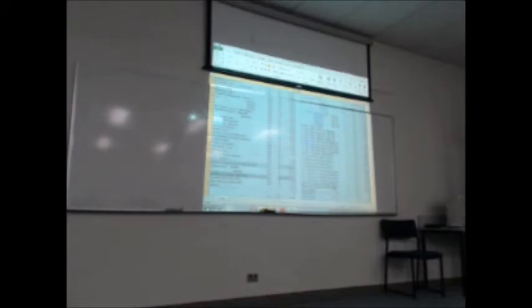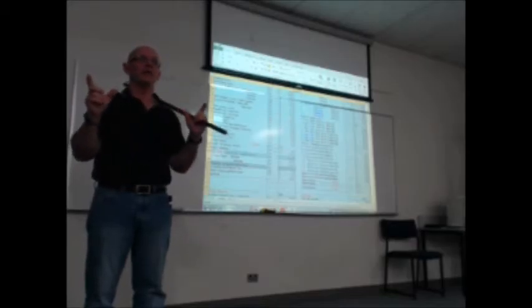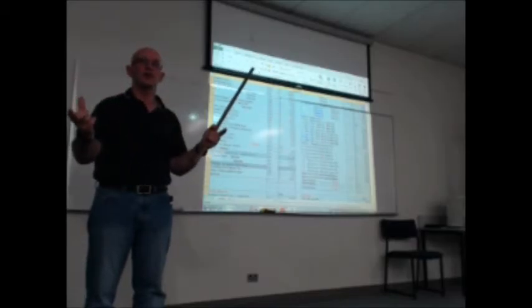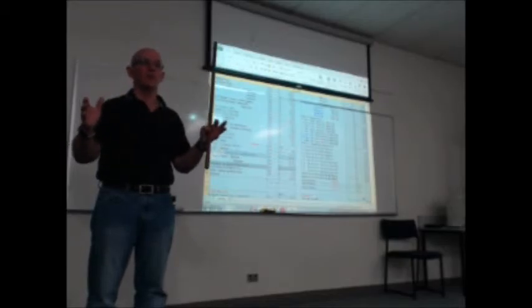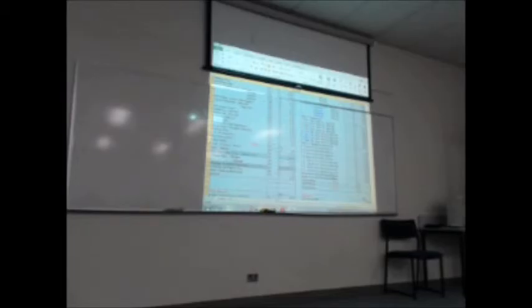A lot of materials, steel for your lintels over your windows. You need to work out what you need. The lintel is 150 each end bigger than the window, so you need to add 300. So if it's an 1800 window, you need to allow for a 2.1 lintel. Okay? Appliances are all there. Fixing materials. So there should be enough prices there.